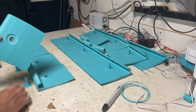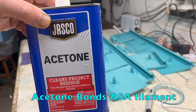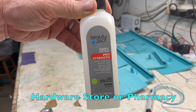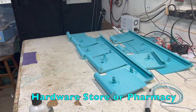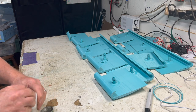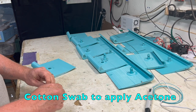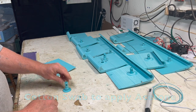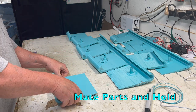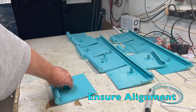For 3D parts assembly, first we'll rough up the mating surfaces of the wing and spindle with sandpaper. Next, align the spindle so that the holes are perpendicular to the wing. Acetone bonds ASA filament together exceedingly well — pick up acetone from the hardware store or the pharmacy. You only need a little bit. Be careful not to get it on your skin — I should be wearing gloves here. Cotton swabs are great applicators. Put a good coat of acetone on the part, but be careful — too much and your part may warp.